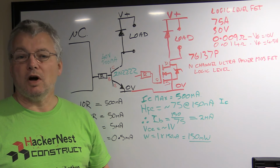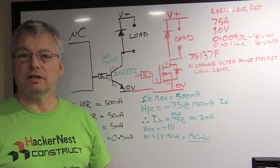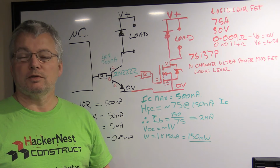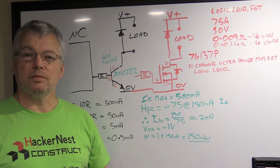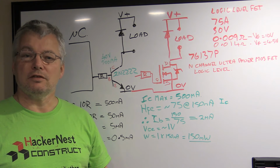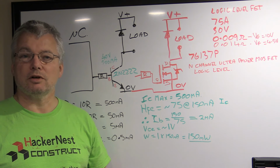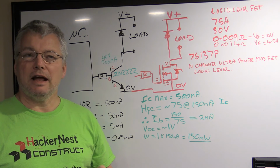To be honest, some of them will work fine, but some of them really are just overloading the microcontroller and potentially causing problems. I've actually seen people connecting motors directly to an Arduino, for instance. If you have a really small one, maybe that'll work to a certain extent, but you are risking damage to the microcontroller because of back EMFs when you stop driving it, and those can generate a lot of volts out of the motor and can damage the microcontroller input-output ports. So given that, how do you do this?